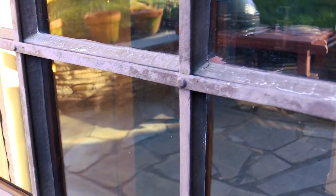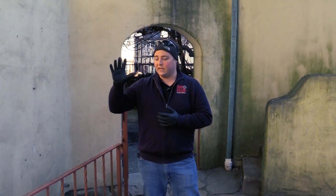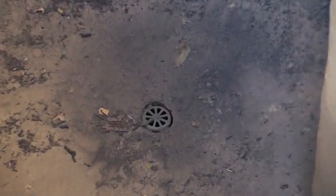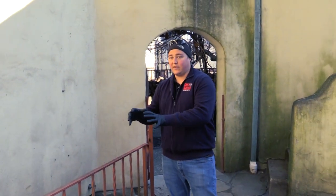There's some flaky paint on that door — I'm not trying to strip it, just clean it, and it looks like it's in good enough condition. There's also a bird's nest on top of one of the shutters. I like pointing that out to the customer to see if they want me to remove it or just hit it with a light rinse. Down here we also have a drain — if that storm drain isn't cleaned out and I'm flooding this entire stairwell, I have the possibility of flooding their basement. Knowing these things ahead of time saves a lot of headache.